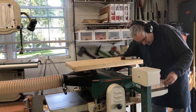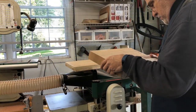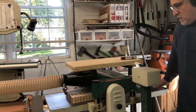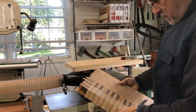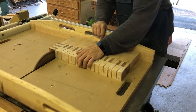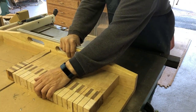This is a little bit scary, but it all worked out really good. You can also do this if you had a wide belt drum sander. There you can see that chip out. So once I had it nice and flat, then I'm taking over to the table saw and table saw sled. You can see I'm cutting off the sacrificial piece of the board.